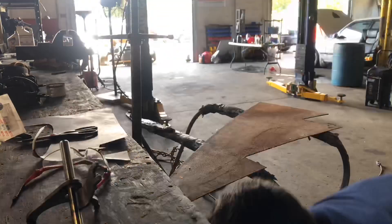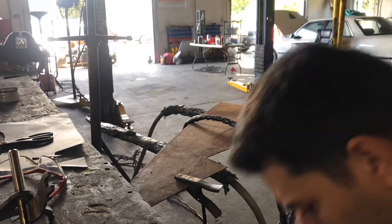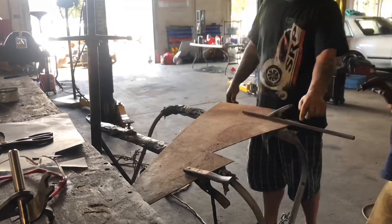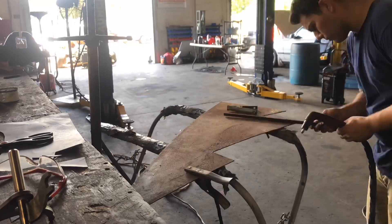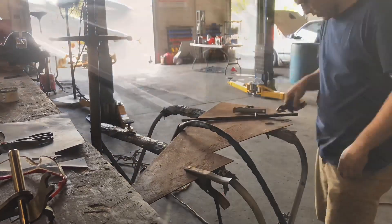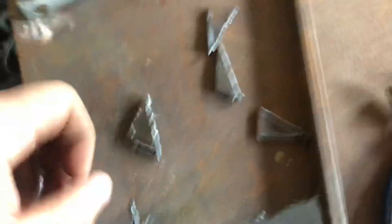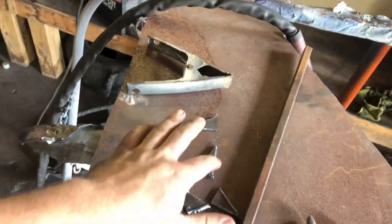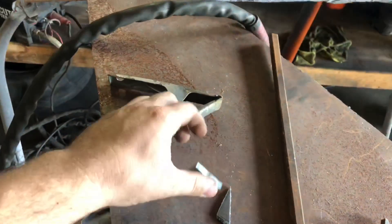A little bit of a rough cut — I like how this one came out. They aren't all 100% even; I think I'm going to be using these two. I'm going to take this to the grinder right now and clean off all the rust as well as all the sharp edges, that way we can get a clean penetrating weld on there.